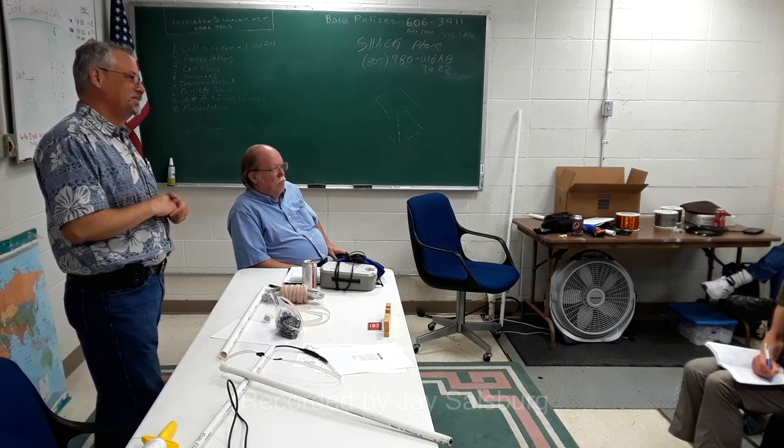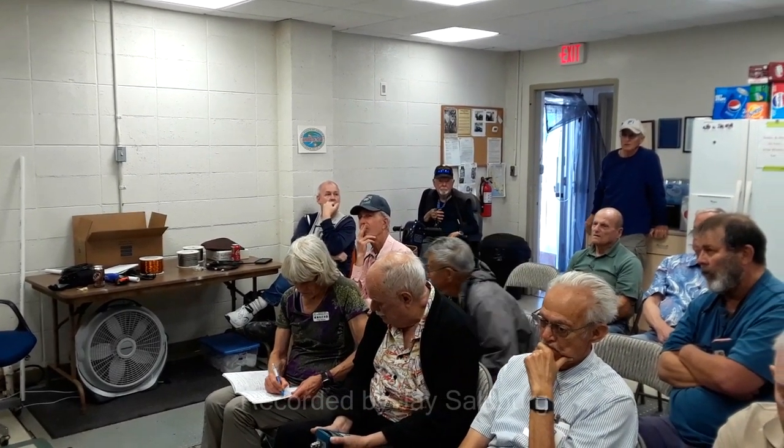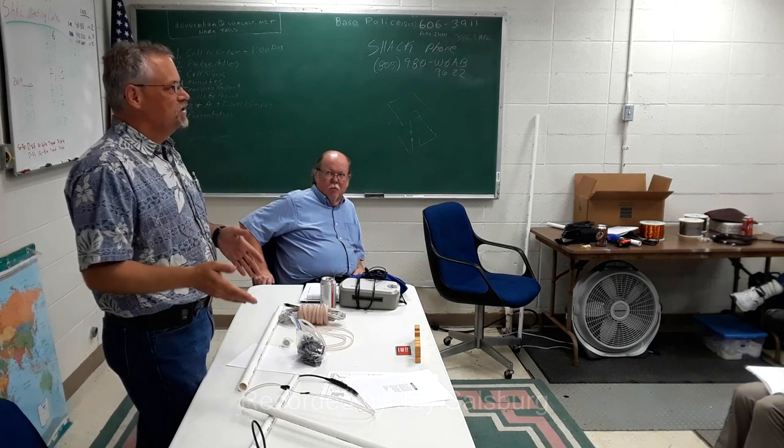You would prefer, though, also a starter battery, but a deep cycle battery? Well, it depends on the application. I'm not an expert on batteries, just for my own use of them. A deep cycle may not necessarily be the best choice for every application. So I would encourage that you do your own research on that and dig into it. Because they make certain batteries for certain applications, right? Some batteries are built more for high current, short usage, a starter battery. And then others are going to be ruggedized for lower current over a longer period of time.